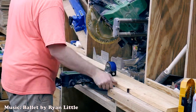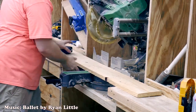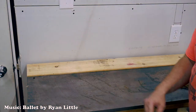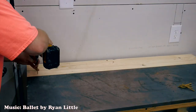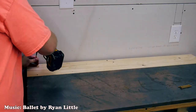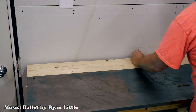Here I have a piece of pallet wood that I'm cutting to make the filler strip behind the steel portion of the table. I didn't like how thick it was and how it stepped up, so I planed it down to get it to the exact thickness of the tabletop and make a nice smooth transition from front to back. That ought to make it easier for me to lay out things that I'm welding as well.